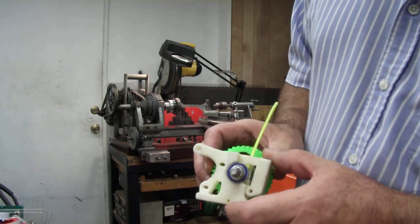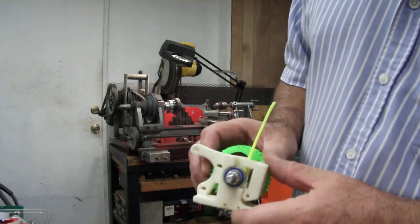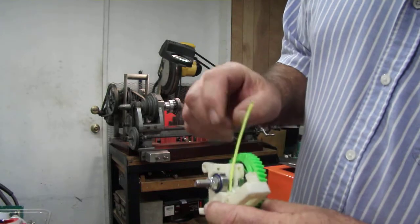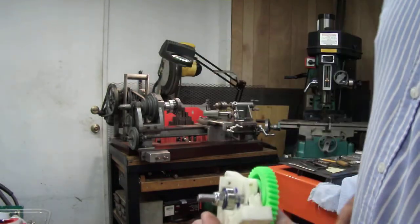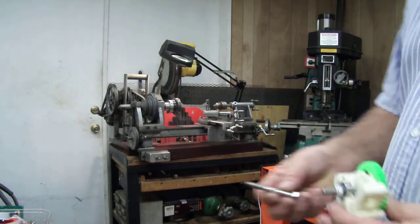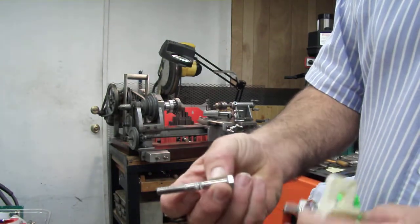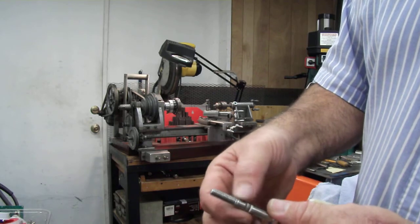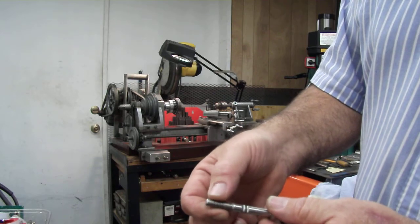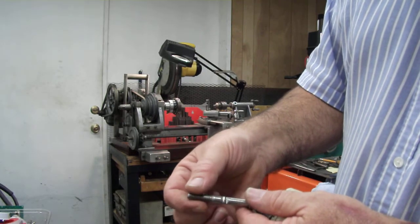It's the hinged version. The filament is in here, and this bolt is not hobbed at this moment. But here's what a hob bolt looks like — it's got serrations in the bolt itself. That's what actually moves the filament down into the extruder as it turns.